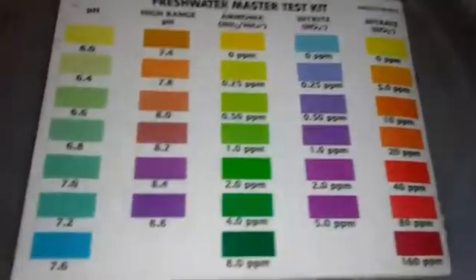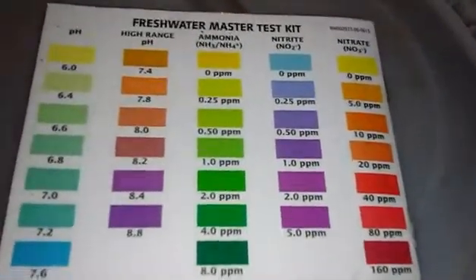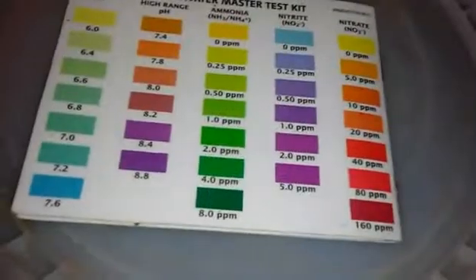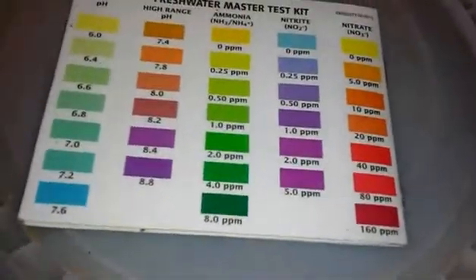I was installing the sand filter for the purpose of cleaning my rainwater. But this is evidence right here. And this is simply play sand — the most simple design. We got gravel on the bottom. Right on top of the gravel, we have a layer of biochar that I made homemade, that I had left over in a jar. And this is all play sand. Then the pipe just comes right here, and I just have a tee covered with some landscaping cloth to keep any larger debris from getting into the pipe.